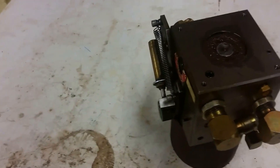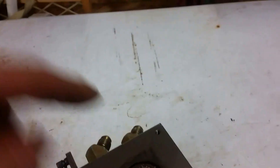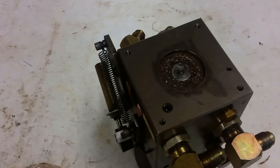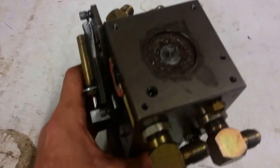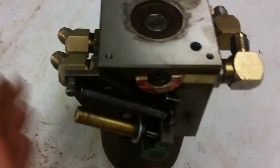It was seized in the downward position, which was low pressure. The stylus had sloppy movement — it was not pressurized. There was a lot of corrosion down in that hole. I took it all apart, ran Scotch-Brite in there. It's kind of like a spool with springs on it that allows more or less pressure — kind of like a pressure relief.